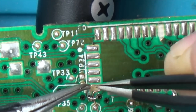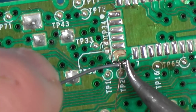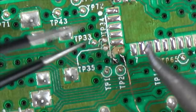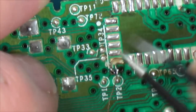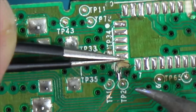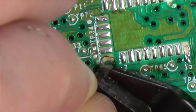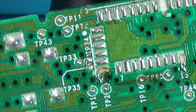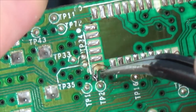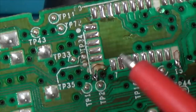Anyway, right, I've got to do that now about six more times, I think it was, or maybe a little bit more to all the other missing pads. And then now I've got to just solder on the board onto every single pad. But that should be easy enough, because although they're small, realistically, there is enough room to get your iron in there comfortably on each one individually. So it's easier than having to replace a little chip with, for example, 100 legs or something on it.